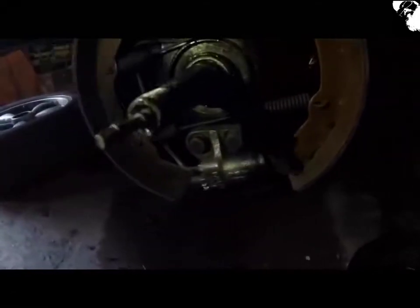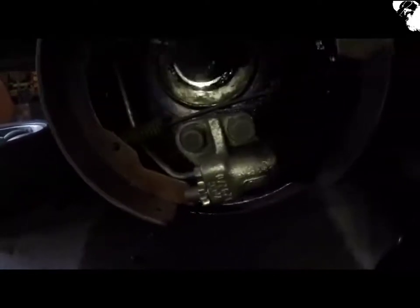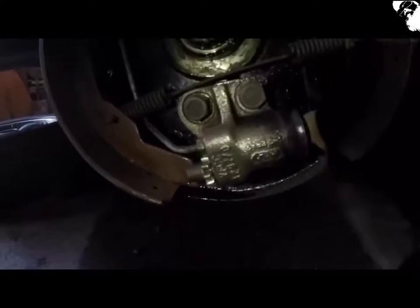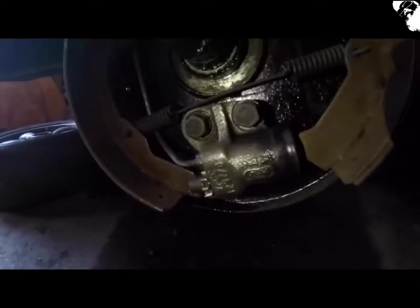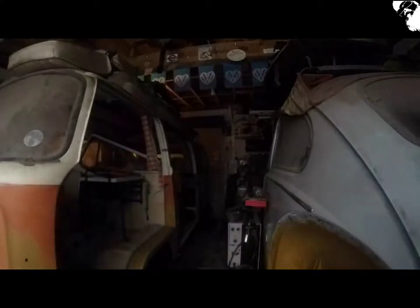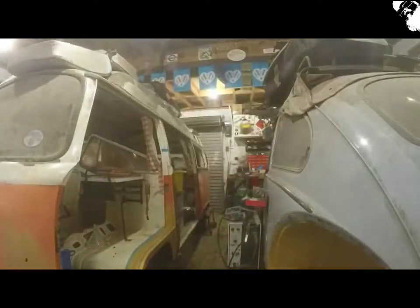Right, quickly whip that wheel off. There's the leak, and it looks to be a faulty wheel cylinder — maybe that bottom one. I just stopped working for about an hour on the bus and ordered that brake cylinder. I've also installed the new light fittings. Those bulkheads weren't cutting it, so I've now got open bayonets but with the LED bulbs.